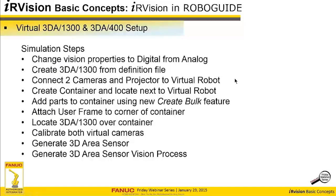With the bin picking simulation, there's a new fixture type called 'container' — an empty box — with a unique way of adding parts. You can add a fixture container, give it the size, and then do 'create bulk' which drops a bunch of parts in: they won't interlock and they'll end up in random positions. Now we'll go back to RoboGuide and bring in our 3D area sensor. We'll change our properties to digital, create the 3D area sensor, then connect the two cameras and projector to the robot. The container is already created — I'll just turn it on and we're going to add some parts and then locate the sensor over the container.